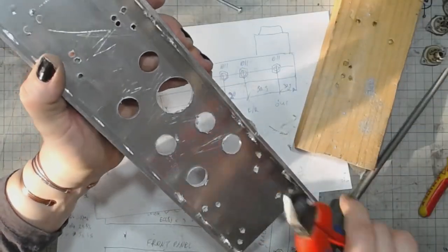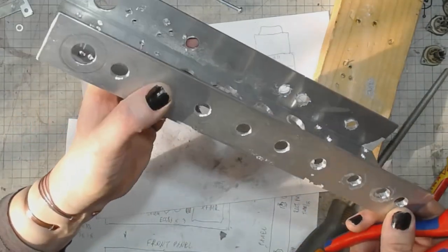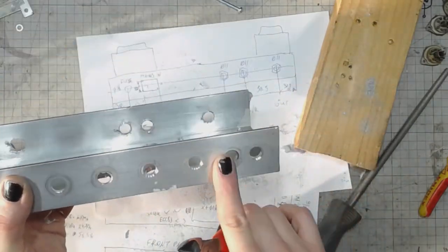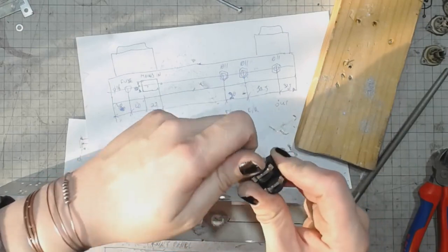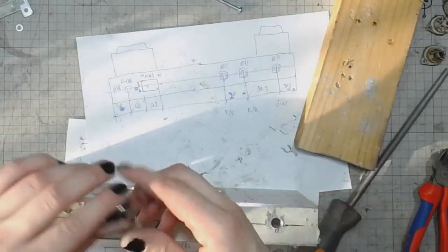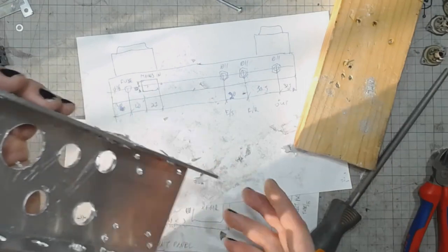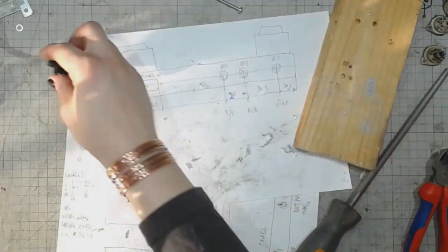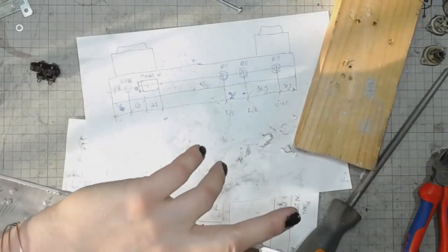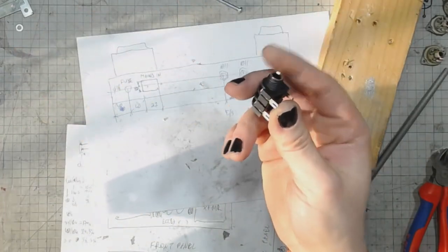This is gonna be a lot of boring work. I will do all those small holes of the camera. I will also have to enlarge all the quarter inch jack holes, they need to be 11 millimeters rather than 10. I drilled them at 10. I wouldn't drill them at 12 because otherwise I would have the jack just moving in the hole. I would have to turn down the nut extra tight.